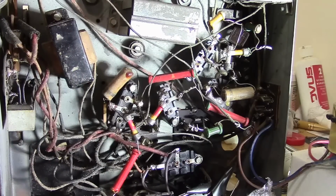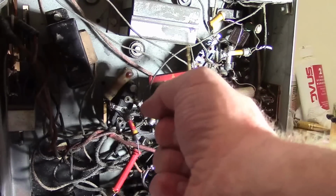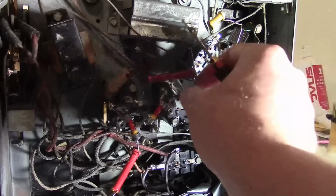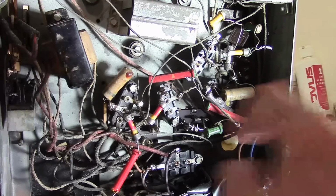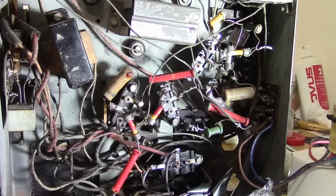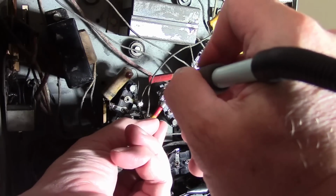Where to start? I want to use that technique of doing it in place, but with so much stuff attached to this, I know I can't really move it too well. This resistor has pretty heavy leads and it's not very mobile, plus we got this stuff attached here too. What to do? Well, I'll try to take this off without destroying it. I'm going to see if I can get lucky just by heating this up and grabbing the part and trying to unwrap it. Sometimes that works.